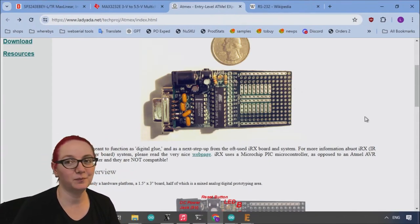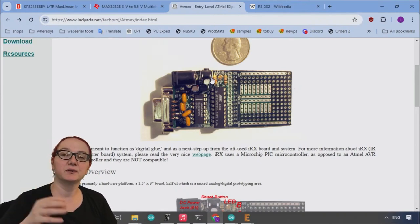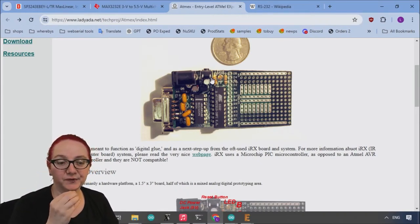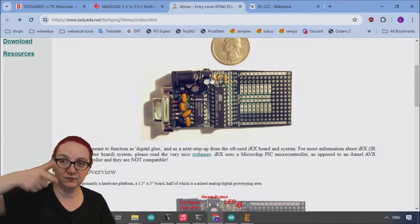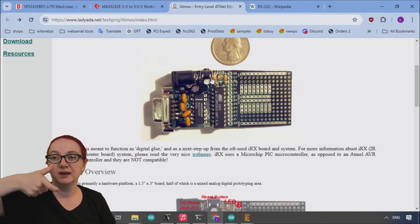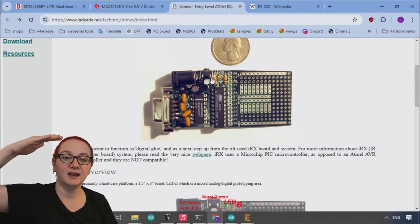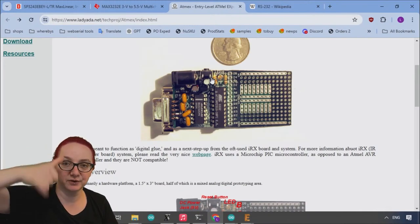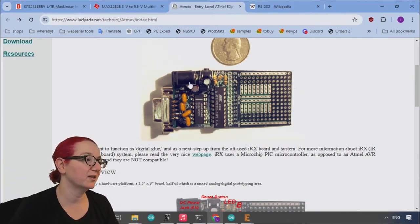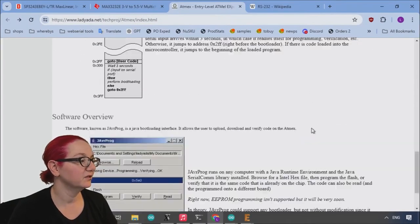You needed four capacitors. Whatever the input power supply — here it's 5 volts — you need a capacitor on the input, then another capacitor to double the voltage, because you use it as a charge pump: you flip the voltage back and forth to double it. That gets you from 5 to 10 volts. Then you have an inverter that takes the 10 volts and converts it to negative 10 volts — that's another capacitor.